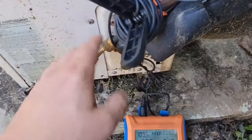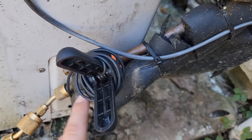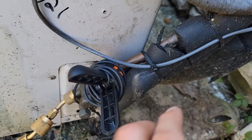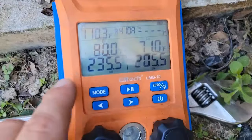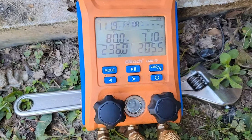Let's go check the outdoor unit. The outdoor unit is running. We've got our low side hose hooked up to the vapor connection and our temperature clamp to measure the temperature of the vapor line. Temperature is 110 — that's pretty good. The low side pressure is 236 psi.